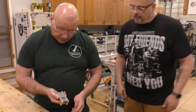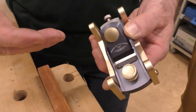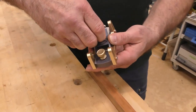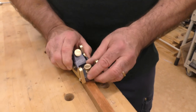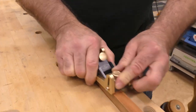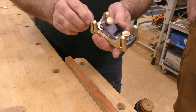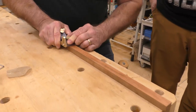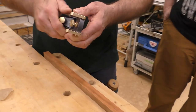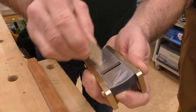Let's set depth on this before we get going. One of the things I want to point out is you don't have to loosen it a ton to get forward momentum. I'm going to take a quick swipe — not getting anything right now. I'll loosen it just a little, about a quarter turn, and just work up to it. You just need to find the right pressure with fine adjustments. It's so thin — it's crazy. Just work your way up, give it a little more bite, and you'll start getting that fine shaving.